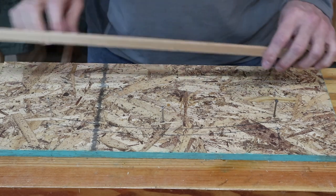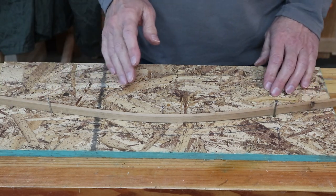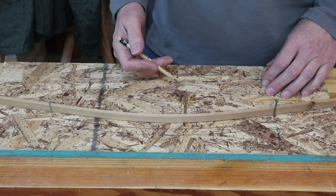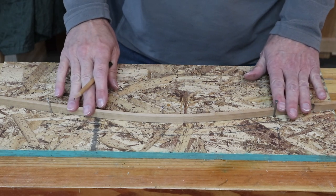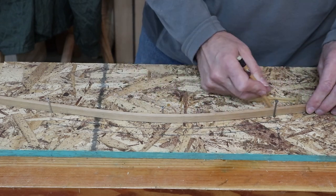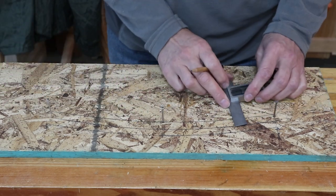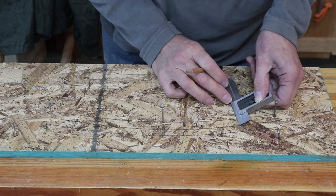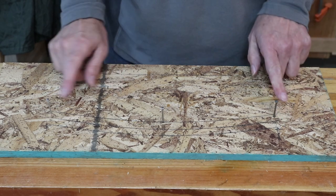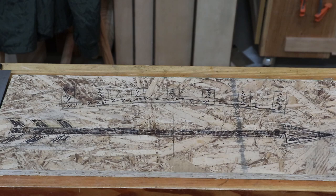What I'm doing right now is marking out the pattern using basically a bent piece of wood — there are lots of ways to do this. You can use a trammel, which is essentially a giant compass, or a router with a circle jig, which works really well too. This method is just easier for setup. I'm marking on the back side, following the wood, and now I have my two lines marked — a little more than a half inch. Now I'll mark out the end pieces and put in the rays, then come back to mark out the arrow.